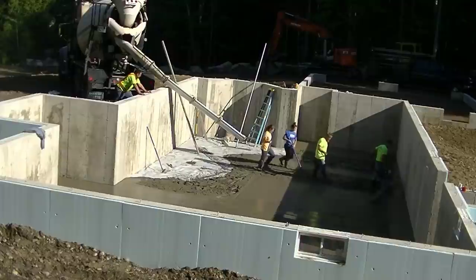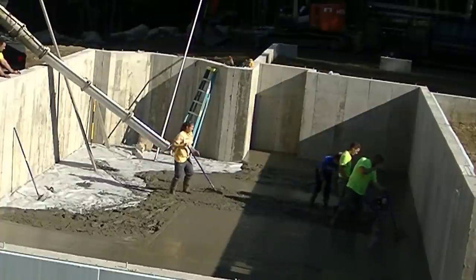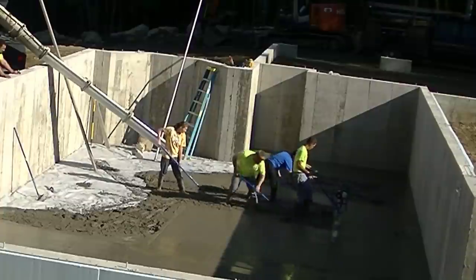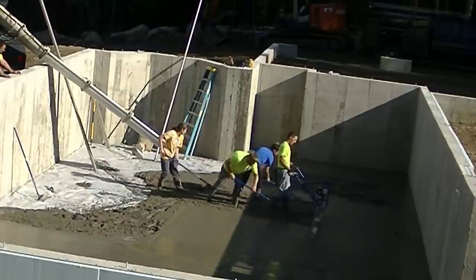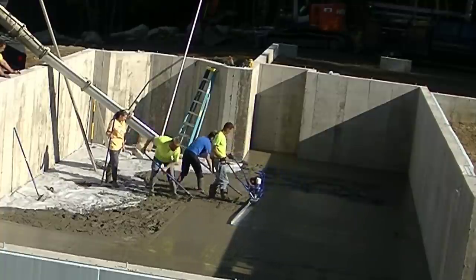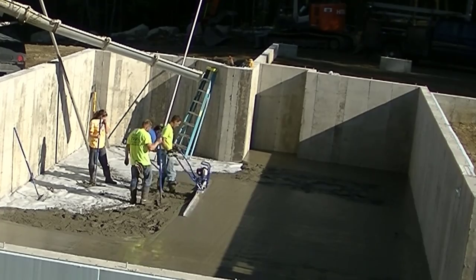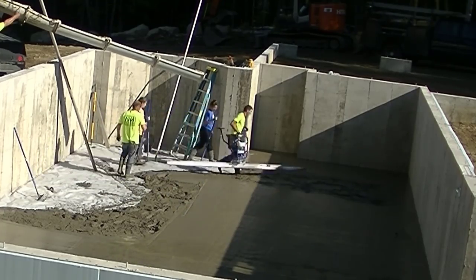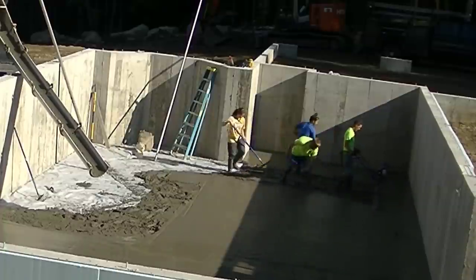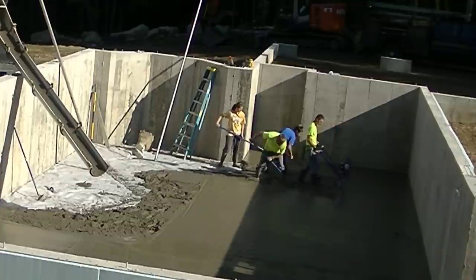You can see me picking that up — it's not too heavy, probably about 40 pounds right there with everything. The key really is the two rakers — if they can keep that concrete just a little bit high, you can move right along really fast and you don't have to worry about any dips or humps. You can see how smooth that comes out after I screed it — nice and level. So if you were thinking of getting a power screed and didn't know which one to get, you can't really go wrong if you get this one.